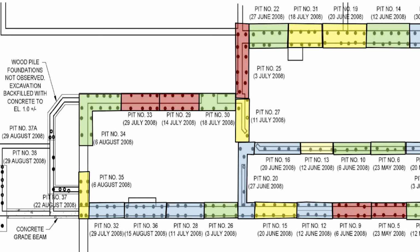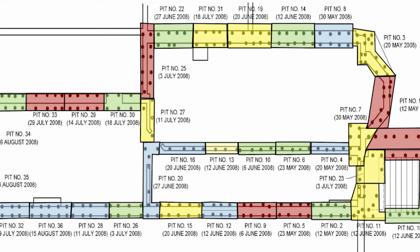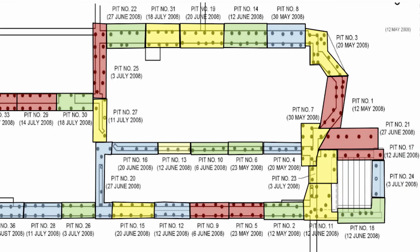So once they do all that for those 8 piles, you do it all over again the next week. So if a building has 400 piles underneath it and you're doing 8 piles at a time and you're doing a pit a week, that's where the months-long process comes in. You usually will find that the cost to repair the piles beneath that building might be around $250,000. And it can fluctuate up or down, depending on a lot of things, much of which is what you, the owner, will allow the contractor to have for access to the building.